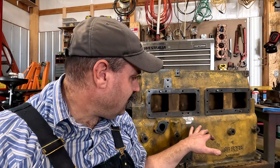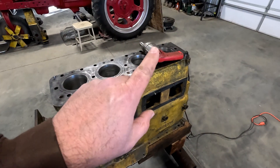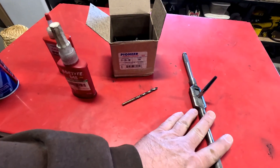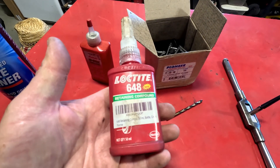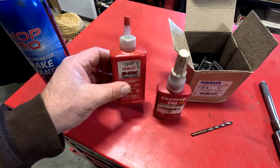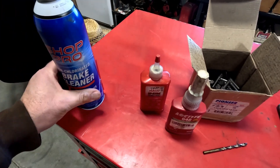It's in a place I'm not too concerned about because of where it is — I just don't want it to spread. Getting set up to drill this; dad's got the drill out over here. For this repair I've got my tap, my drill, the plugs, and I'm using Loctite 648 — the green Loctite like we used on the bearings — and Tap Magic for thread cutting, and some brake cleaner to clean it off.